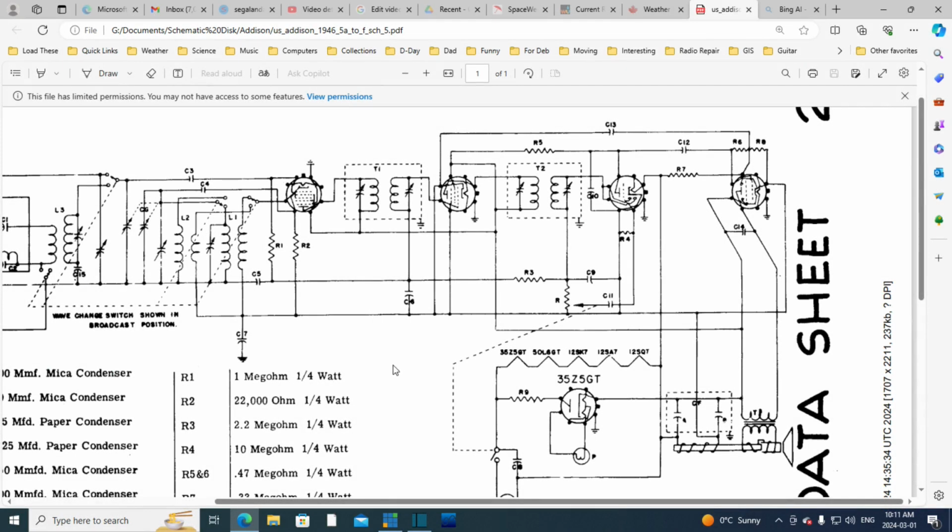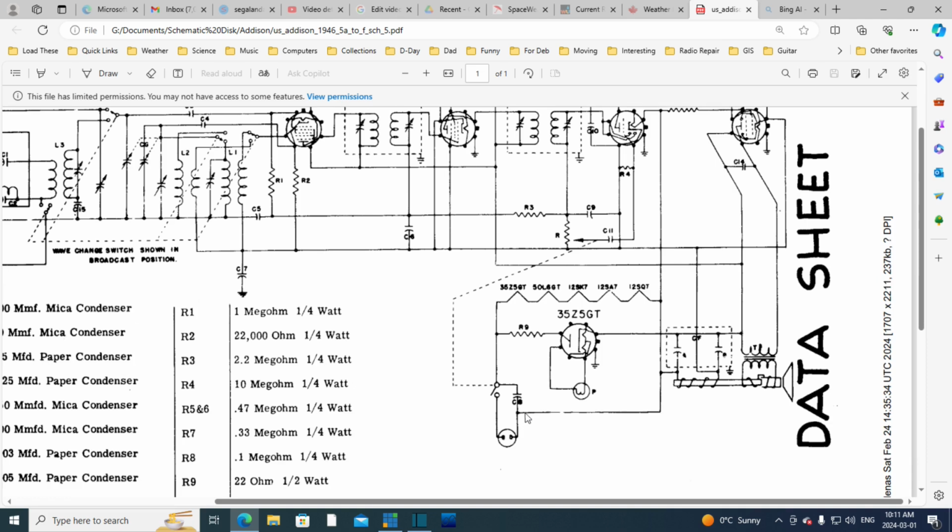Okay, so the two wax capacitors we're looking at are this one, C14, and this guy, C8. Now, when I replaced this one, I stuck in a special X-type capacitor. Probably wasted it here. I should have really put it in this position, but I'll just put another one in. So this one is obviously right across the power line. It's on the far side of the switch.